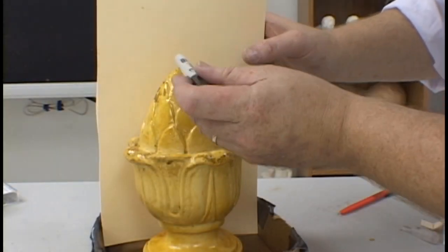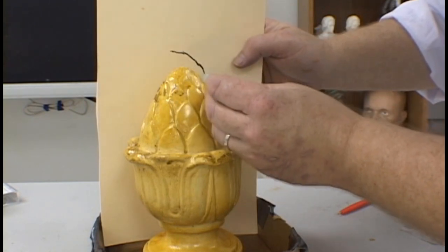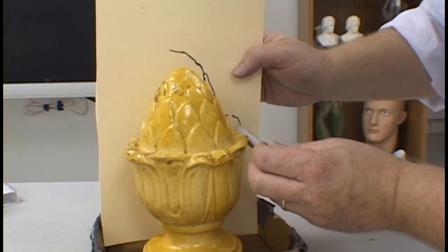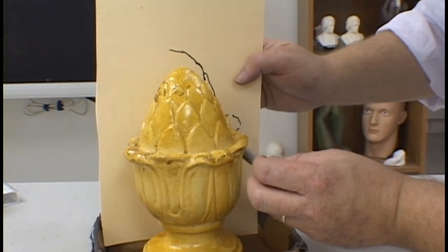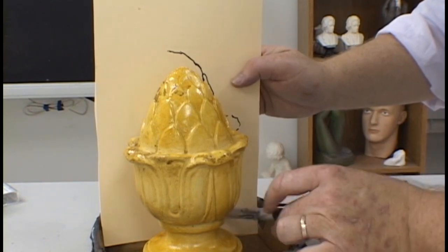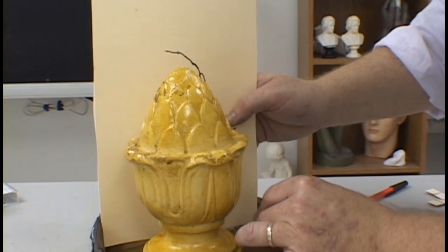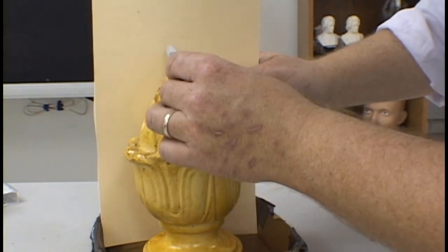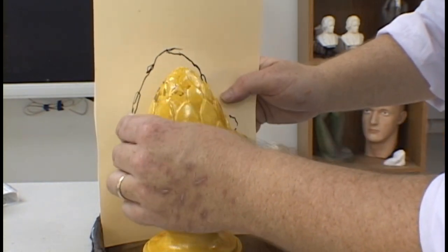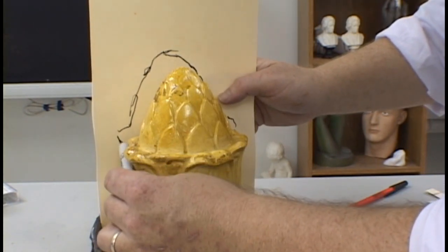We are now ready to start cutting out the parting plane for our mold. Use a marker to follow along the edges of the part. This is just a rough guideline to begin your first cut. It will take trial and error repeatedly to get a nice fitting parting plane. Try and stay inside of the outer edge of the part, as it's always easier to cut away a little extra than it is to try and put back something that was taken away.